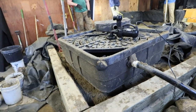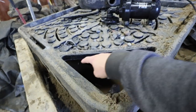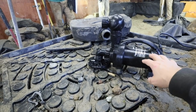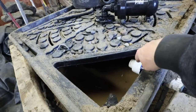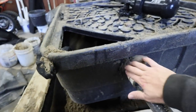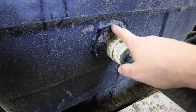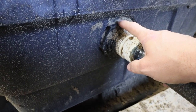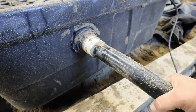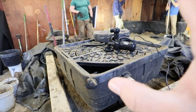For this particular waterfall, we're going to use what's called an Aquabasin — it's a preformed unit that basically creates a water storage area. There's a compartment that houses our pump; we're going to use a 2000 gallon an hour Aquasurge pump. We have this tied into the side of the unit using a bulkhead, which gives us the ability to penetrate liner or plastic and still make a watertight seal where we can screw fittings into it. Then we go to our flex PVC line, which gets glued in.